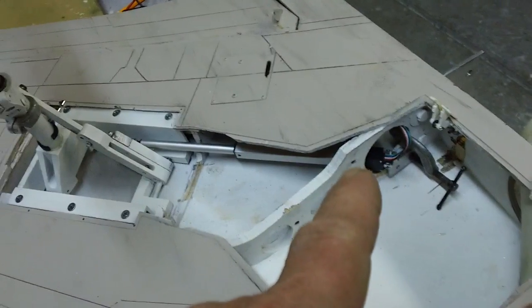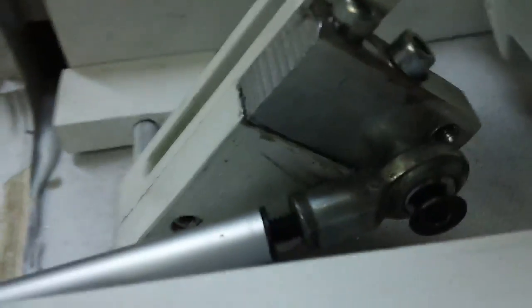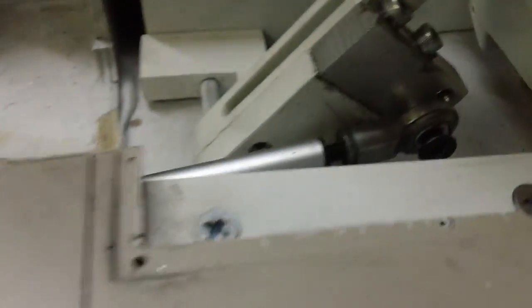That's what I'll call — I'll just tell Malcolm — that's instant gratification. But see, that hole's got to be off center. That hole's just right next to the edge because of the way it bolts on there, the way that flange is. I just got that big ball-length deal right there with a countersunk screw so it can let it move a little bit. And there's that block I made — that extends that arm. We couldn't do that with air cylinders because it made the stroke too long, and anything over a three-inch stroke on the air cylinders, the shafts get huge. So that's why we didn't go with the bigger one there — they're just monstrous. But that seems to work pretty good.